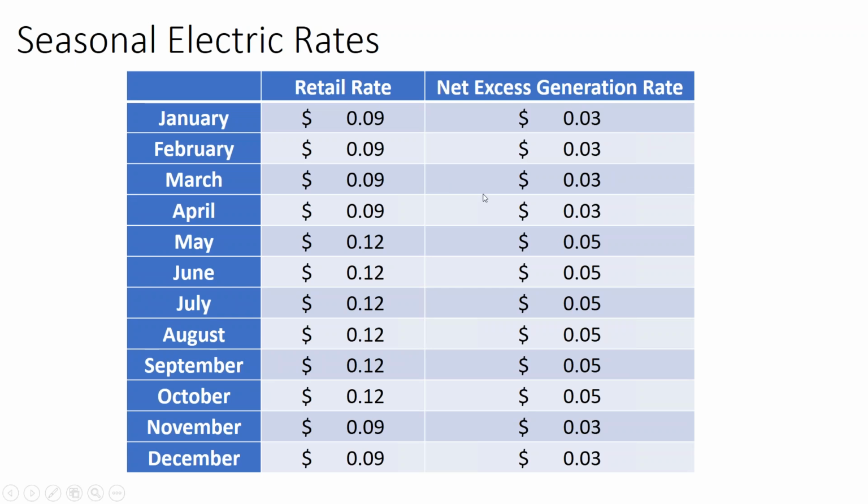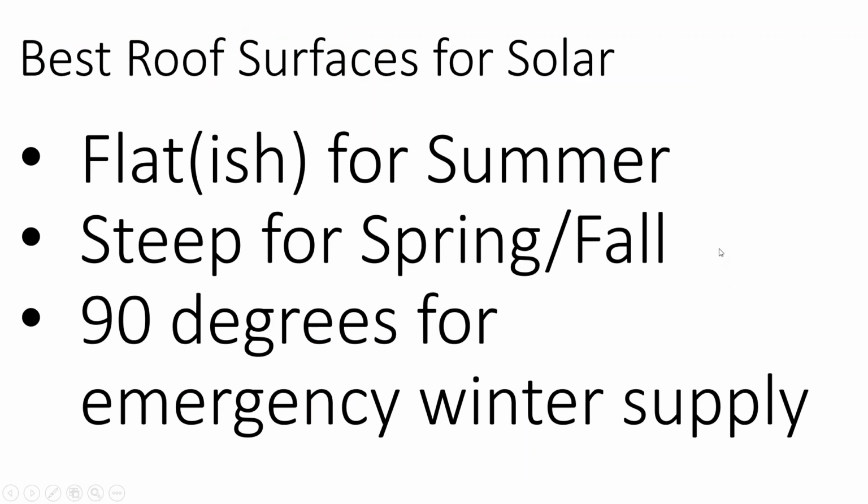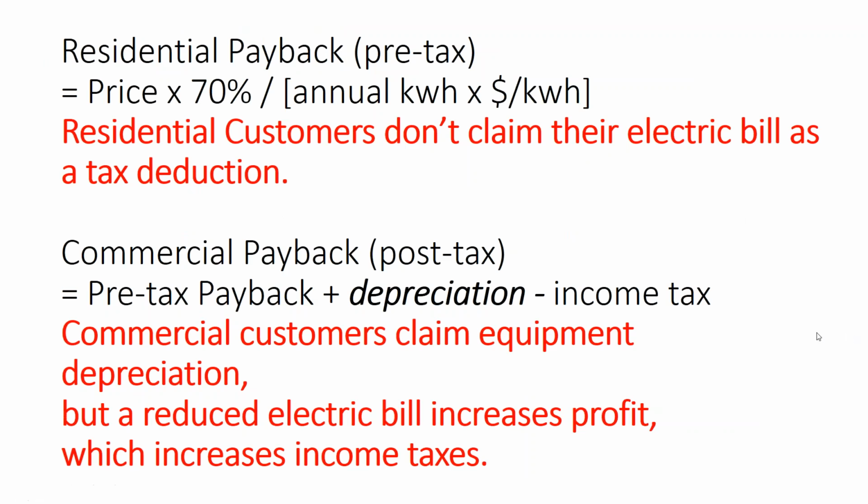Also, that avoided cost electricity rate goes up in the summertime and down in the wintertime. One item that even makes net metering policies a little weaker and also makes the avoided cost a little weaker, and sometimes I have to go back and challenge the utilities on this. The Tennessee Valley Authority has their solar program, if you want retail value for the array. It's less than retail value now. So if you want something close to retail value for your solar array, you actually have to plug it into the grid and sell all of the electricity to the TVA.